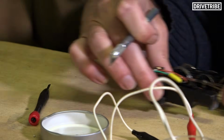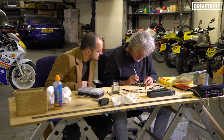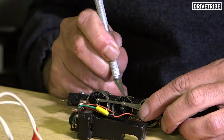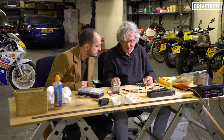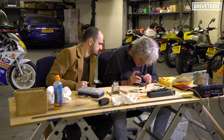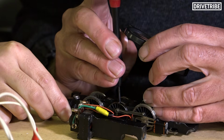How precise does that placing need to be? Can that move along horizontally? It can a bit, but not too far, otherwise if it's too far one way or the other, it will either completely miss the, yeah, that just moved a fraction then. It will either miss the worm and it will jump, or it will bind with it. Bugger. To hold it. That's a good, yes please. That's a good sign though, that it moved a bit more easily.